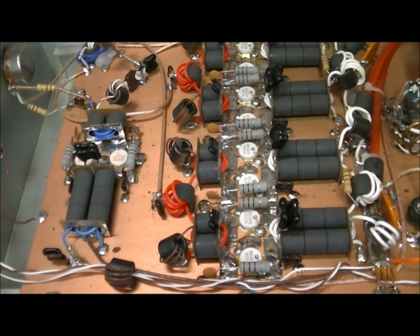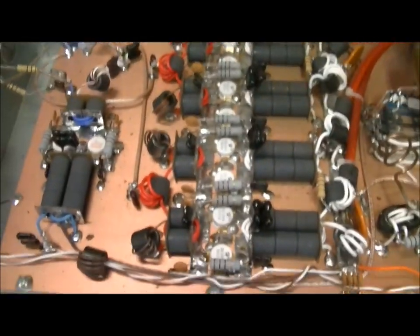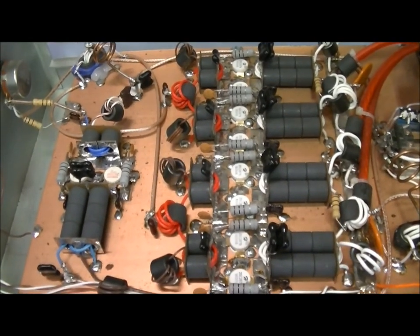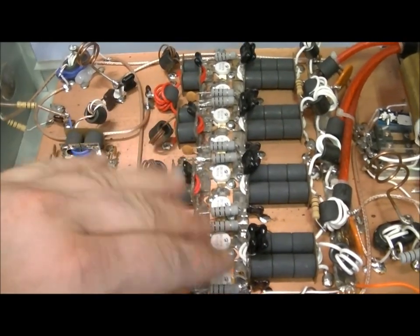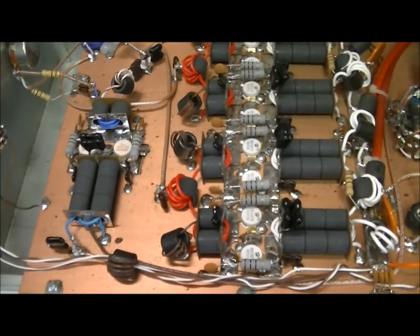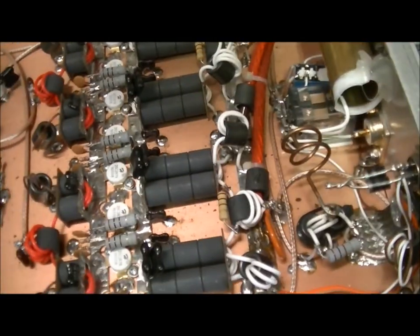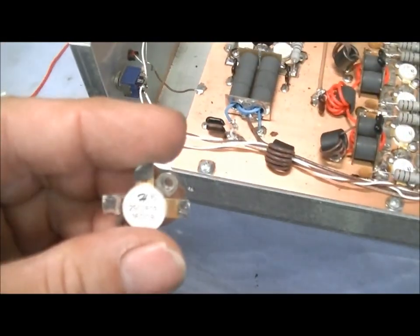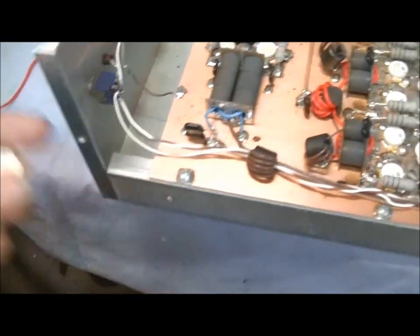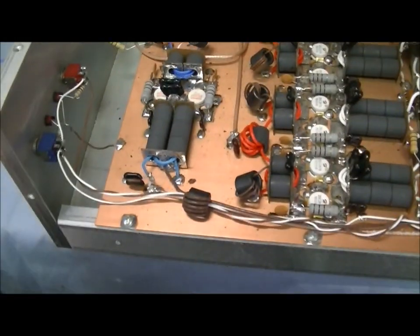I hate it. I really do hate it when it comes to HGs and Chinese type transistors, but usually it's good to go ahead and replace at least the 4-pill section, if not all of them. But luckily we're able to do that. So here is the remaining good HG. Pretty low HFE value. We can trade that in towards the cost if you want, or I can send that back to you.